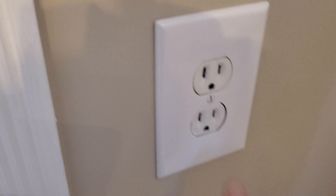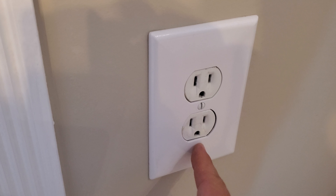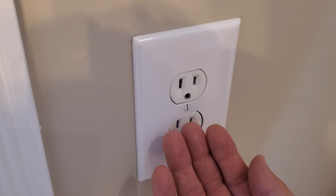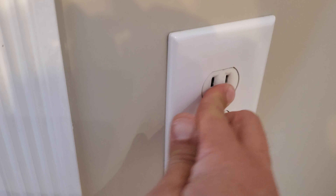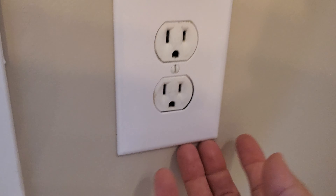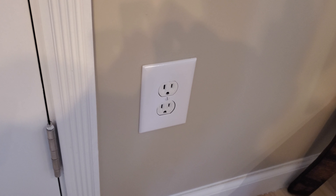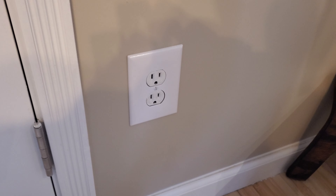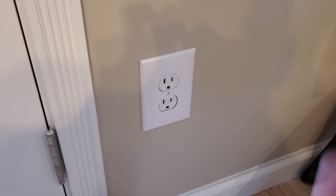What I could do is go back, take this plate off, turn the bottom screw another probably two turns, which would allow some more play in that outlet and suck it up to that end of the cover. It's pretty sturdy in there, so your drywall is all covered. It's just a quick fix — I don't know if that's to code, but it's just a couple turns of a screw and it does work.